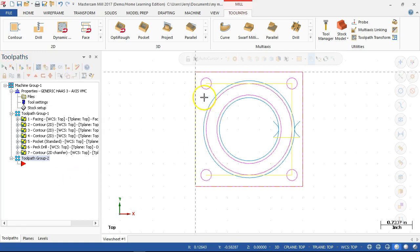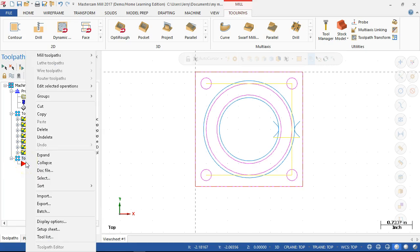We're going to be able to machine in the same orientation with pretty much the same 0, 0, right? And be able to face this because we're not picking up geometry or doing anything over the top on this particular part. I just need to remove the material and it will be in this same orientation. There's nothing on the side, nothing on this backside that I'm overly concerned with. So the tool path group allows me to separate these items out.